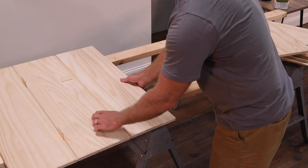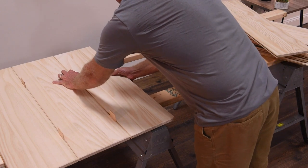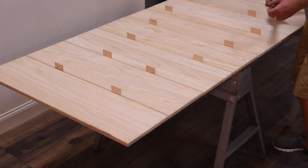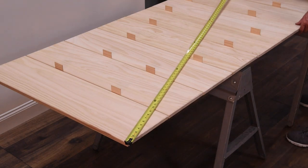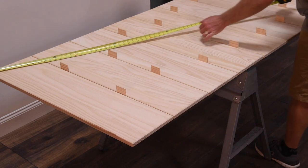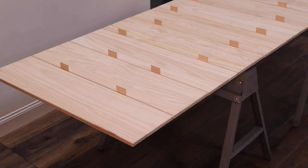The last panel will also be an end panel with no groove on the outer edge. Next, make sure the door is square by measuring diagonally from both directions. These measurements must be equal. If necessary, adjust the boards until equal with the mallet.